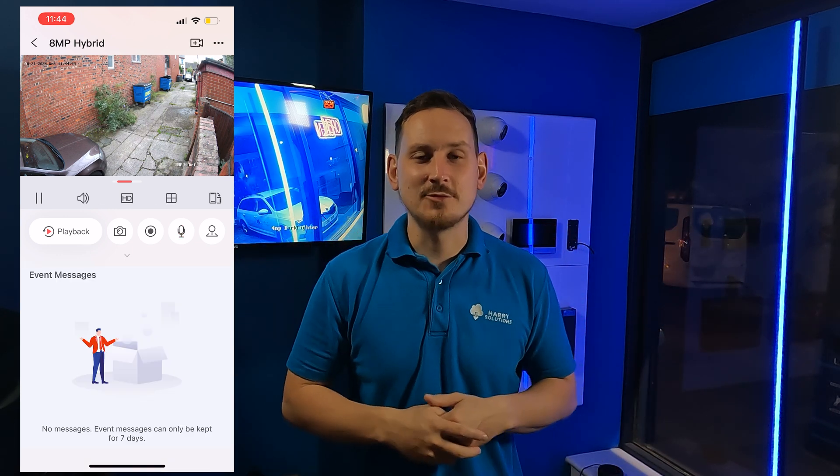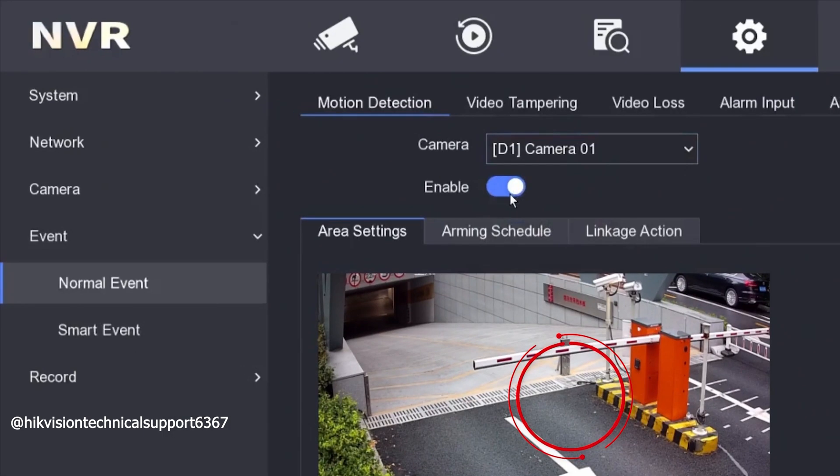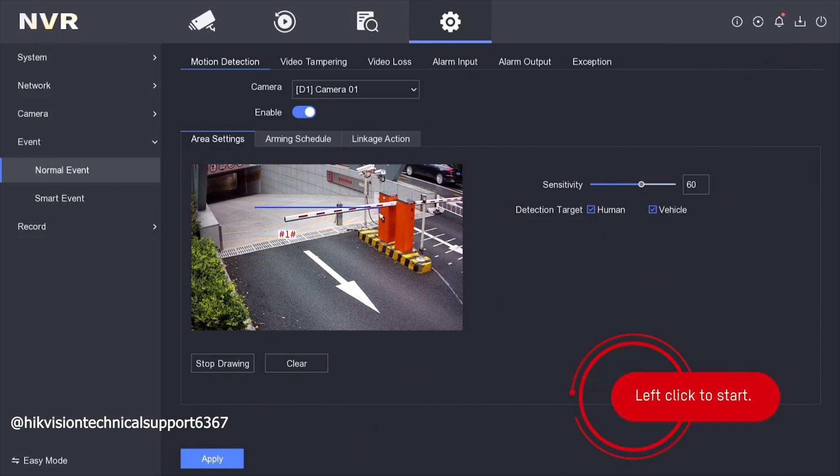If the environment around the camera is too noisy and there's too much noise pollution being absorbed by the microphone, or the speaker doesn't go loud enough to drown out that noise pollution, it can cause some issues. The second feature I like the most is the events. Notifications have come a long way on CCTV, and this camera packs a whole host of events you can set up — intrusion detection, line crossing detection and many more — which will send notifications to your app. You can also dial it right down so the camera is very specific about whether it triggers for a human or a vehicle, which should hopefully drown out most of your false positives.